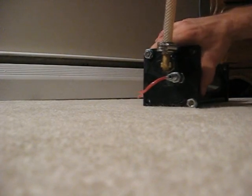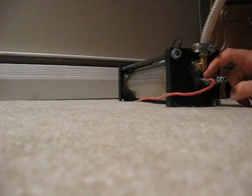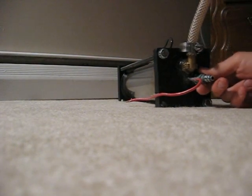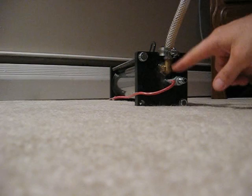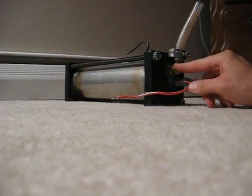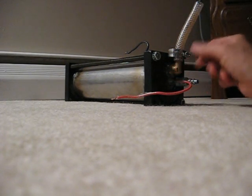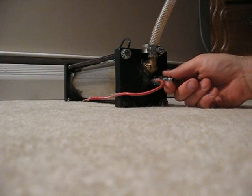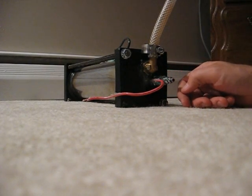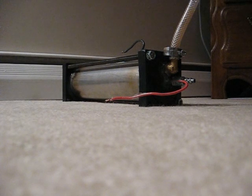On the top, I have a hole with the wire — the positive coming out — and I just epoxied the wire to this fill plug, the fill tube here, so the wire wouldn't move around too much. Here I have a brass fitting, a 90-degree elbow. I drilled and tapped a hole in here for the pipe thread, threaded it in, and this is my gas outlet right here. This is going to be the fill tube — I'll put a 3-8 tube on here with an end cap on the tube for filling the generator. This is my gas outlet, and now I can set up the generator so you can see the production.